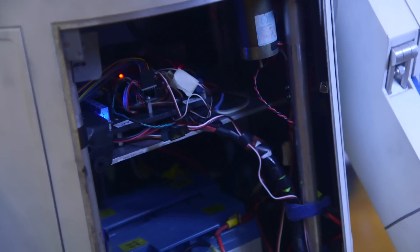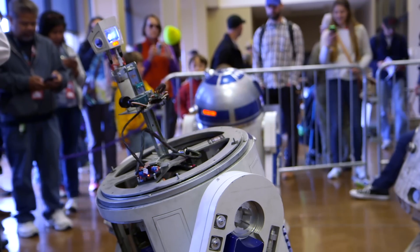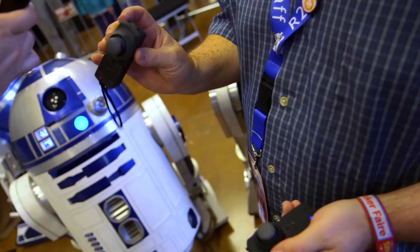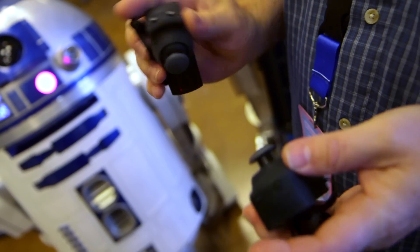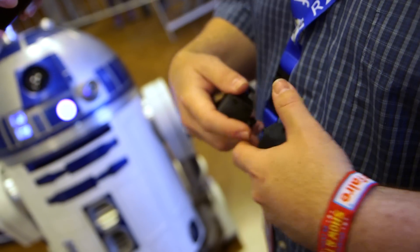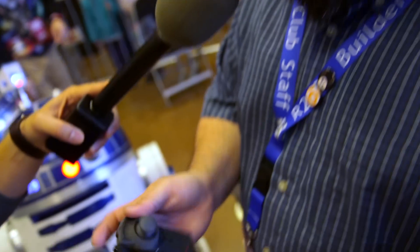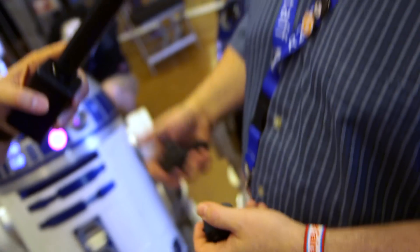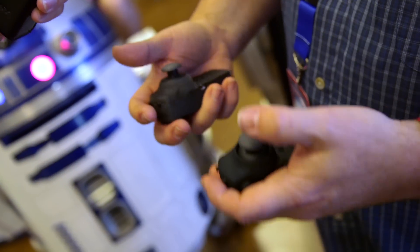What other electronics are inside? It varies a lot. Mine is pretty much tricked out with a lot of custom electronics, but you could get away with just a regular RC type radio — the kind you'd fly a plane or a little model car with. It all depends on how much you want it to actuate: if you want your periscope to come up, if you want panels to flip open. The way I'm controlling this is custom-built and 3D printed — these are small controllers I've developed over the last couple of years. My goal is to make R2 feel magical, as if it's real, so running around with big RC controllers spoils the illusion. I've developed little pocket remotes I can hide in my jacket or pocket. There's also a scripting language and gesture system, as well as buttons to trigger things — if I want to open a panel, I just click and flick the joystick, and all the panels open up.